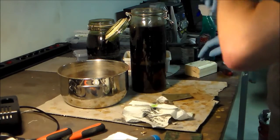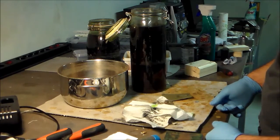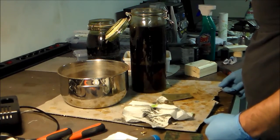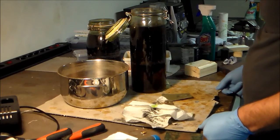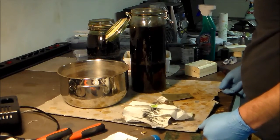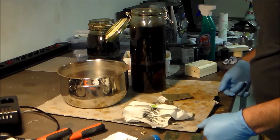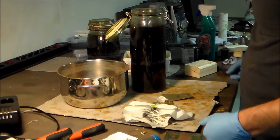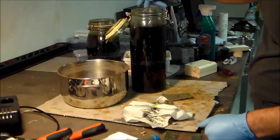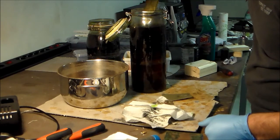Now, normally, I have a process for etching Damascus steel, and I have a slightly different process for etching Wootz. And the Wootz one is actually quite a bit trickier to get it to look decent, but if I do this one like that, then the Damascus will be etched very deep, which is not ideal for a kitchen knife. And a kitchen knife, you really don't want deep ridges where you can have germs and things.